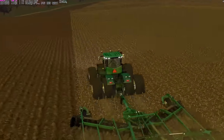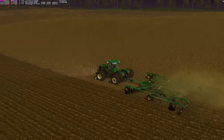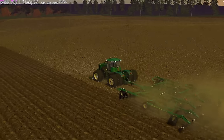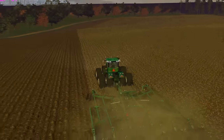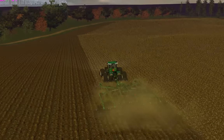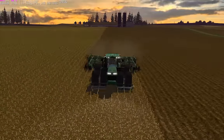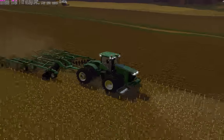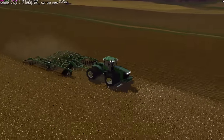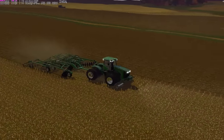So moral of the story is you cannot plant after this. I don't care what kind of planter you have, you really can't plant after this, because you'd have such difference in your terrain, your seed placement would be terrible, and your row units would be bouncing all over the place. Even in those new John Deere high speed planters, there's no way you'd be able to keep your row box from your row unit from bouncing all over the place, unless you pretty much made it completely rigid.